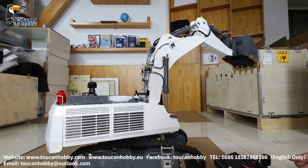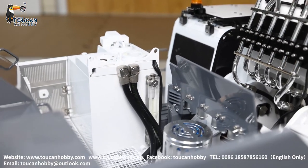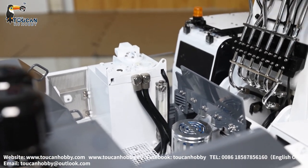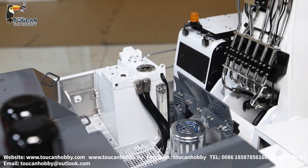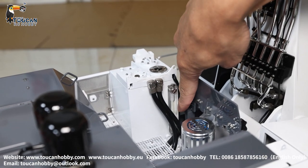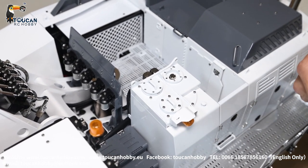Now check again the oil level. Check the oil tank. It looks like the level is not dropping too much because maybe originally in the cylinder there was already oil, so the oil level is keeping like this — it's enough. Sometimes before I send it out, I will drain the oil in the tank so the system doesn't have oil. After you run it, the oil level will go down, so you can fill up a little bit more — a little more than middle, that's enough. Put the cap and secure with six screws.